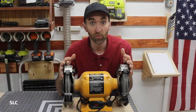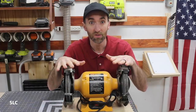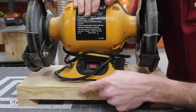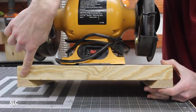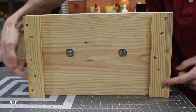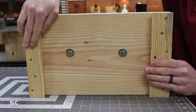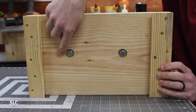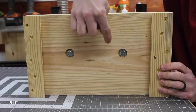Now if you have a grinding wheel, you know they can be really useful, but also they can be a pain because this large of a unit sitting right in the middle of your workbench can just be too much of a space hog. So I have a great way to store it. I've attached this unit to a very thick 2x12 to give it nice strength across the bottom — you don't have to worry about it warping, plus it's a good hard surface to fit onto your workbench. Down on the bottom I've attached a cleat to the right and left sides so you can hang it from either side. I've also used a bunch of screws and glued both of these in very well so it will adhere and stick well, and the screws will also bite into this upper piece of wood, giving it as much strength as possible. Down on the bolts I've had to lower them into the wood a little bit so they'll be nice and flush across the top — so make sure you realize that's going to weaken it just a little bit, so make sure you have a good thick board.